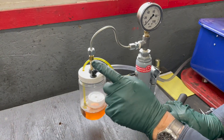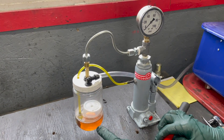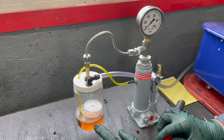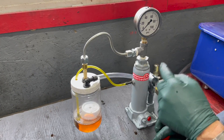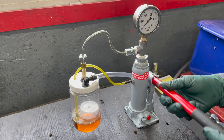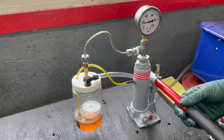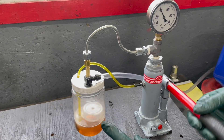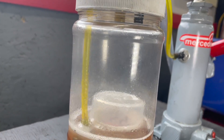You can see I have the new Bosch fuel injector installed in the capture bottle, and we're ready to test this. Notice the color of the fluid — I add a little bit of automatic transmission fluid, a small amount in with this test fluid or cleaner, to help lubricate the seals in the pump. I've closed the valve down on the pump. Watch the gauge — you're going to hear something very interesting when that injector starts firing. Okay, bringing it up over 40, approaching 50. Look at that spray pattern. See how it's atomizing? Listen to the squeak.